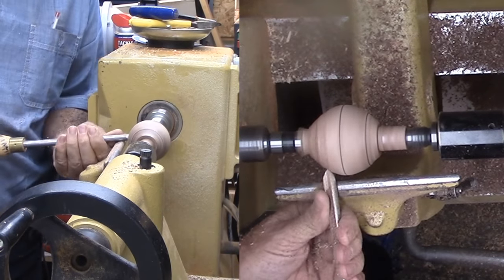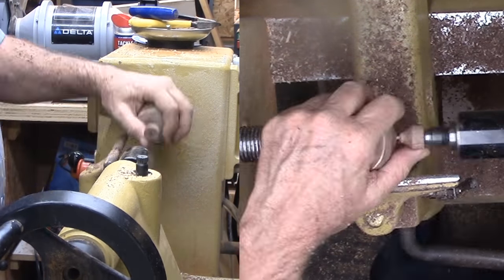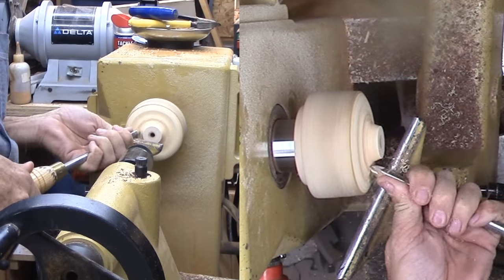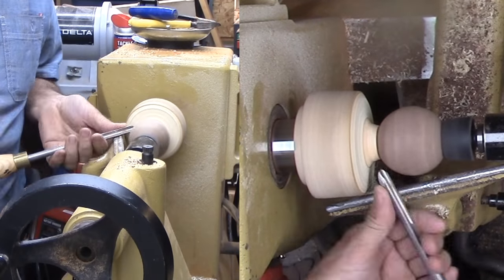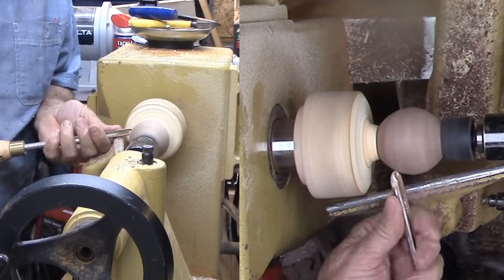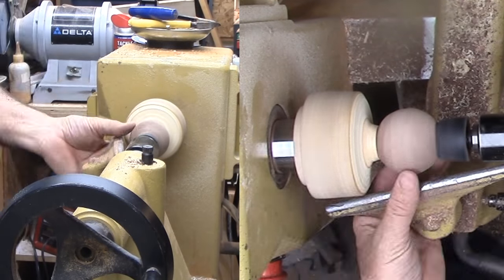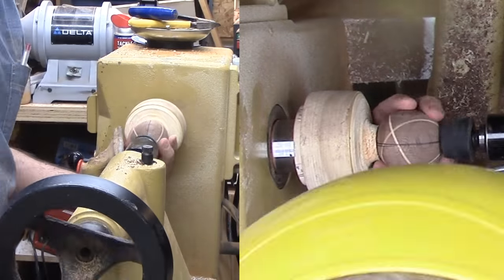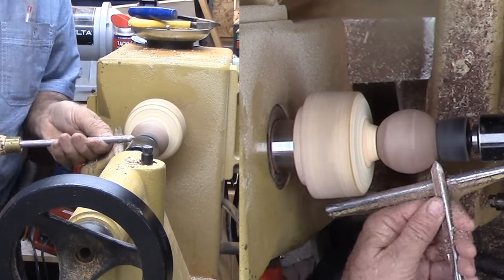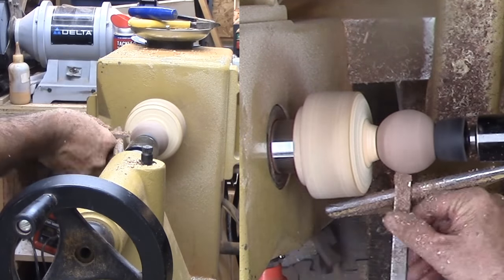I'm now rounding off the octagon to a sphere, then marking a diameter line. Now for the refinement — I'm switching to a cup faceplate. The tail stock has a rubber stopper. I've rotated the spindle 90 degrees to the original turning axis and am using shear scraping to refine the sphere. With that running pretty close, I'm marking a new diameter before rotating another 90 degrees and continuing to shear scrape. With this ball, I mistakenly undercut the original tail stock side so I have some extra work to do — an extra mark and rotate before finishing. If necessary, I would repeat until perfect.